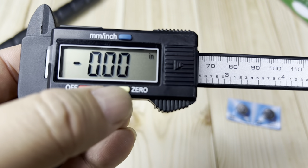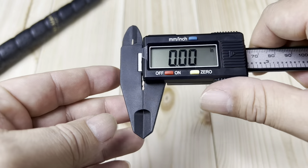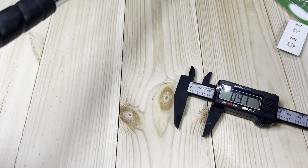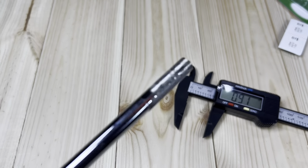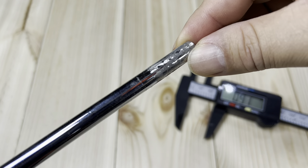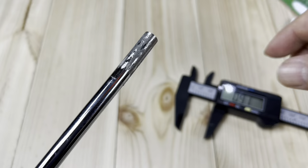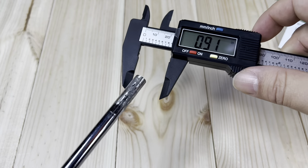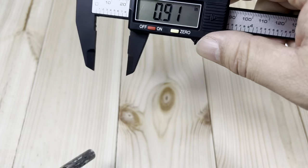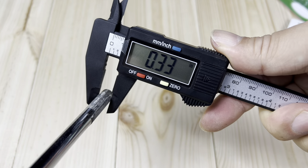You can switch from millimeters to inches. I'm actually going to switch this to inches because I have something I'm trying to measure. You also get two extra batteries. Now I'm going to open this up — I have this golf club here, and what they didn't give me is the diameter of the post. I think it is 0.355 inches, so I'm just going to try to verify that with the calipers and see if they give me that same number.